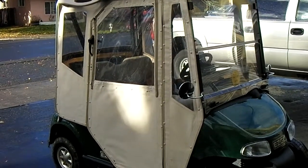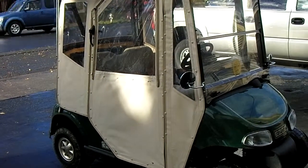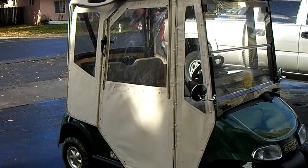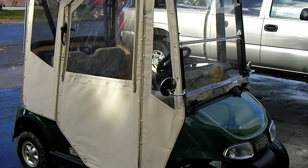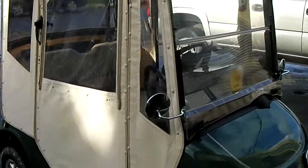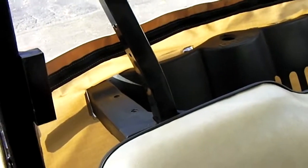Here's one that's pretty much already done, and we had to do what I call a big man modification to it. The Cozy Car Enclosure is about the tightest, nicest enclosure on the market — it's a door enclosure. They're kind of pricey, but they withstand a lot of abuse. I'm going to zoom in and show you some modifications we did because the owner was a big man, and the door kept flying open because it kept hitting the latch. This was the old part where the door latch latched, and we just put another mount up here for it to latch on — just to keep the arm away from the latch and keep the door secure.